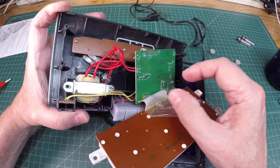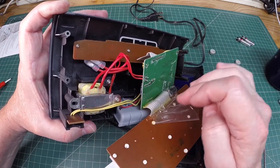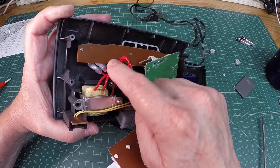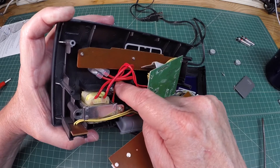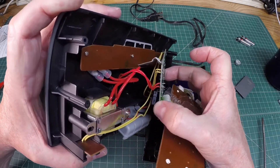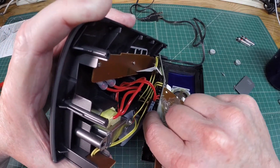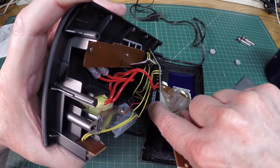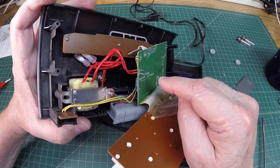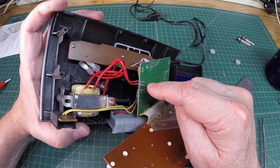Got this thing broken into — everything is still soldered in place with the ribbon cables attached. You can see the power supply here: this is your primary end and this is your secondary output. Going back to the circuit board and the first connection point, it goes right back to this electrolytic capacitor, which would be suspect for me. Let's take the DC meter, get this thing plugged back in, and test our voltage.